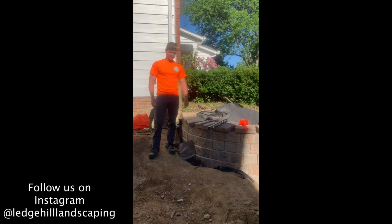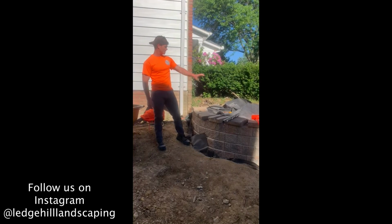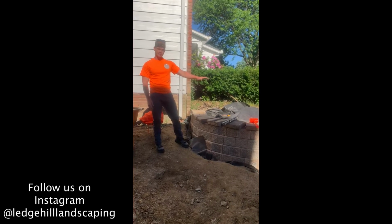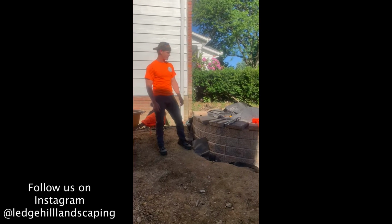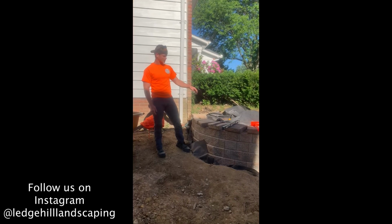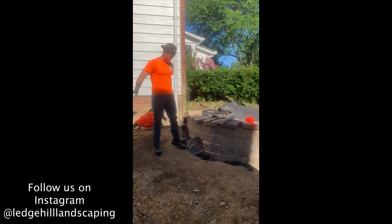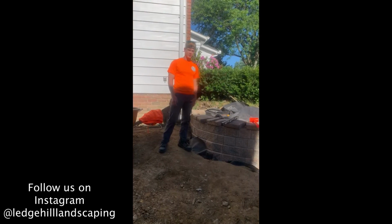We've got our T-square for that and our level, and we'll just get it done. Then we'll come back with 57 about 8 inches from the top of the layer, and then come back with our dirt above that, so there can be a garden and trees, grass to grow and plants, and not be affected by that 57 drainage. Then we'll come back through and do all the grading as well, and from that it'll be done.